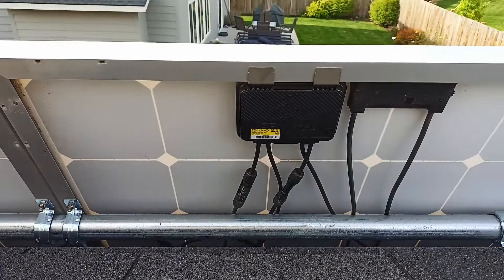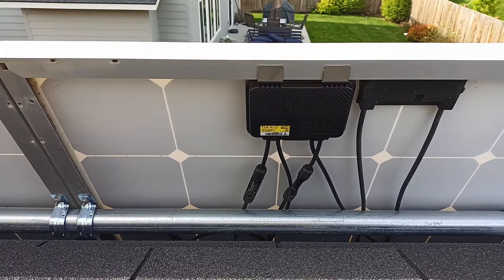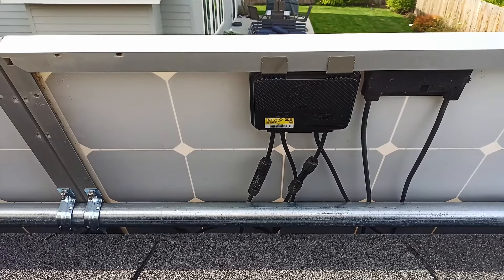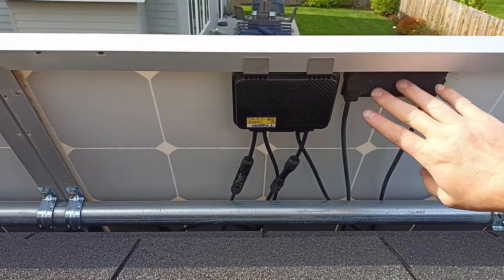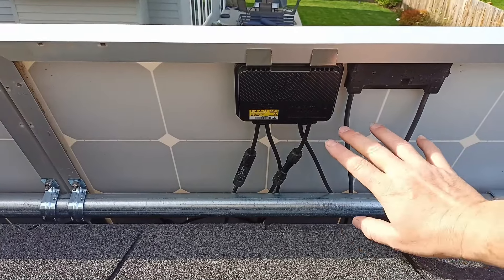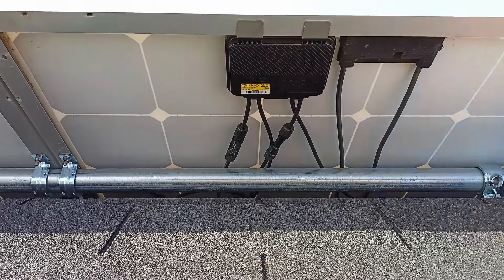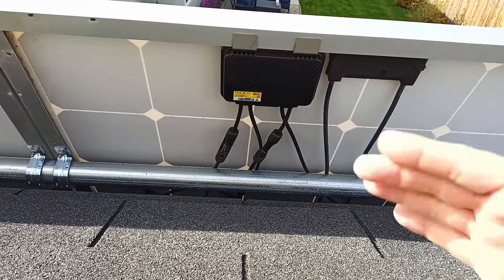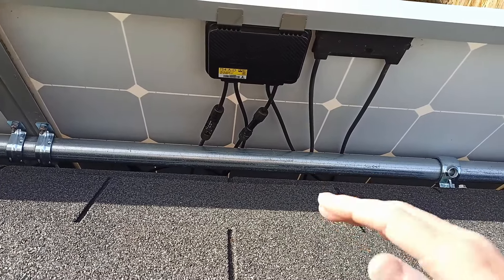To get these to work — they're wireless — you need what's called the TAP unit. Think of it like an access point that broadcasts a keep-alive signal. When you hit the button that keep-alive signal goes away, and these turn off, effectively cutting off the panel because the panels come into the short leads and then back out. So when these get the signal to stop allowing flow, they turn off and that will stop power at the module for safety — for first responders or if you need to shut down the system as a whole.